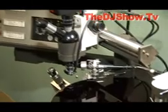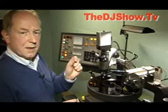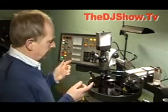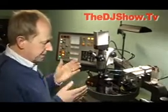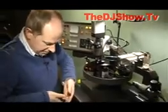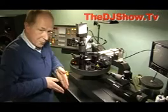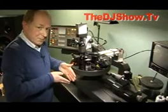If I was cutting an album, then the groove would be less deep than for a 12-inch single. And the reason for that is that the cutting stylus is, if you imagine a triangle, the deeper that you cut down, the wider the groove is across. And for an album where you're very, very tight for space, you can't afford to have a very deep groove. So you'd cut shallower and take up less space for the groove. And that will then mean that you can cut for longer.